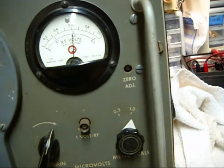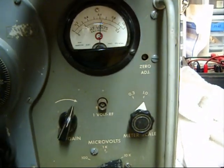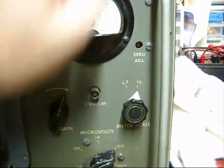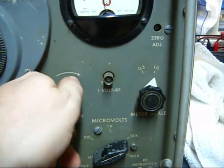The scale seems to be relatively accurate — not dead on, but close. I put a 47 ohm resistor in there instead of the 45 it calls for, but it's what I had. Good enough. This is not exactly a precision instrument, but it'll get the job done.